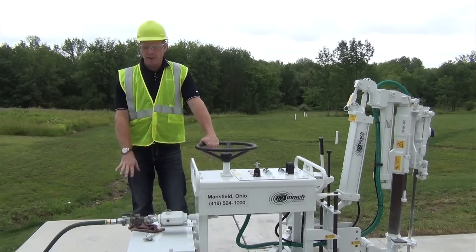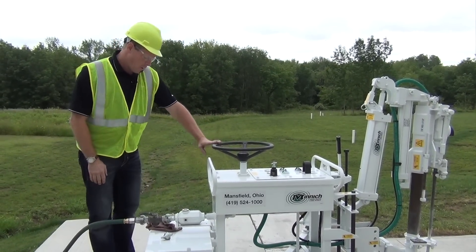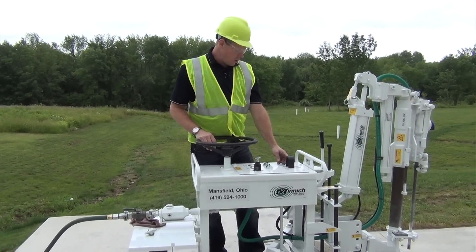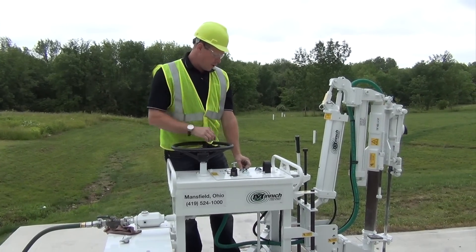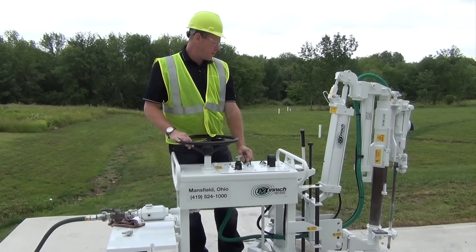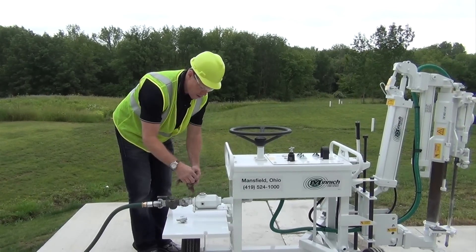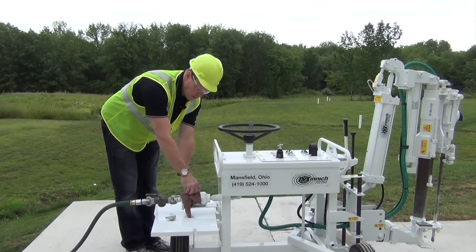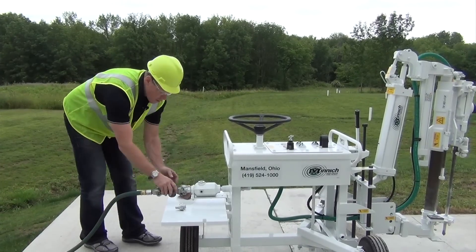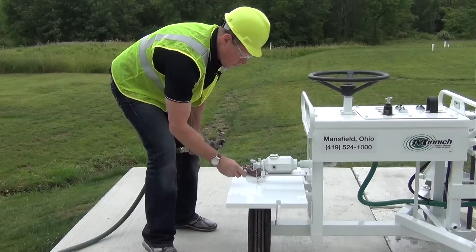Once we've got the bed back in position and we're ready to turn the air off, we need to turn our main source off back at the compressor or wherever your source is. Before we actually disconnect this, we need to relieve the air pressure that's still in here. So we want to go up to our drill and turn the feed valve on and allow that to dissipate. Turn everything to the off position. You also want to relieve any air pressure that's still in the oiler — put a rag over it and push that red valve down. Then you can remove the safety lanyards and replace the cap. Keep that free of debris.